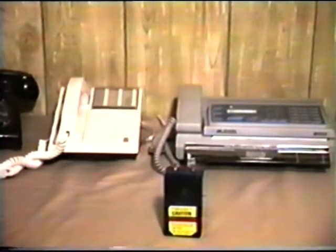A ringback tone is sent down to the pay telephone by the AX computer whenever a person talks over the time period and still owes money for the phone call. When he hangs up and the phone begins to ring, this is what is known as ringback. The AX computer has sent a ringback tone down to the pay telephone to cause it to ring. When you answer a ringback call, the AX computer tells you how much more money you must insert into the pay telephone. Ringback is actually useless to a phone phreak. In fact, the only main key on a green box that is useful to a phone phreak is the coin return key. However, the phone phreak must call another phone phreak using a green box to get his money back.